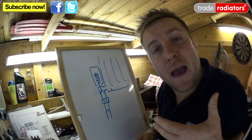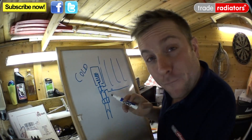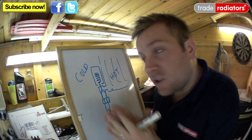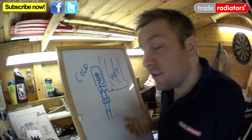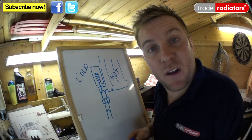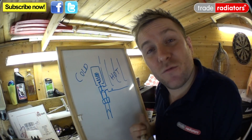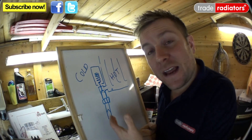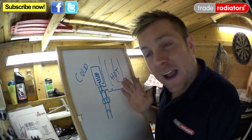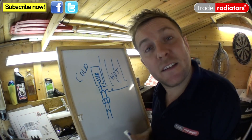This is where we get to a problem with how people actually use their thermostatic radiator valves. Imagine you go into a room and it is cold. You feel the radiator and it's hot — that means the TRV knows the room is cold and has the radiator on to try and heat it up. A lot of people will then look at the numbers on the valve, see something like 3 out of 10, and because the room is cold, turn it up to 10, meaning it will never shut down. The biggest reason you fit one of these is to save money on your heating bills, so turning it to maximum means you'll never save any money.